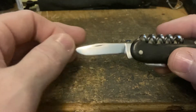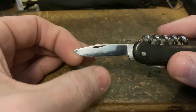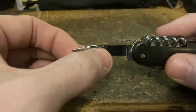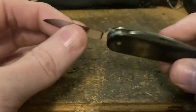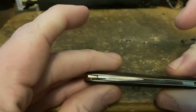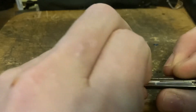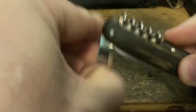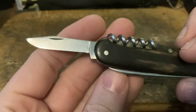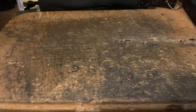Last but not least is this lovely, perfectly shaped clip blade. To me this is the perfect shape for a small clip blade — a nice profile, very close to the original. It's got that nice little swedge on top. The reason the swedge is there is to make it easier to get to the nail nick, give a little more clearance so it doesn't hit the main blade when closing. Either way, it looks great — a lovely little knife, one of my favorites.